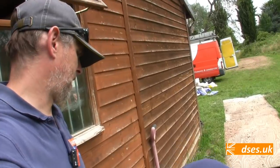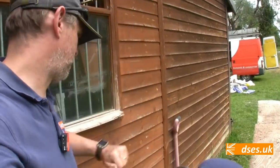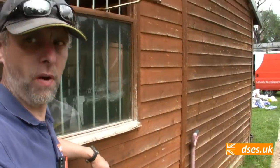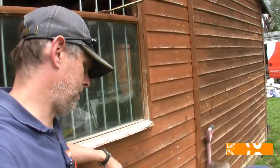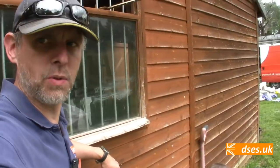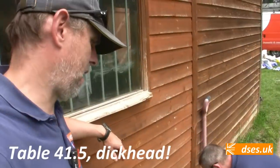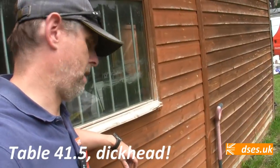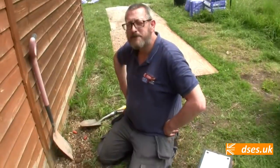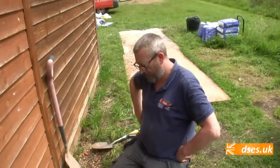Obviously, it could be as high as 1,667 ohms for a 30 milliamp RCD if you divide a touch voltage of 50 volts by 30 milliamps. Then you get a maximum resistance of 1,667 ohms, which is in table 50 whatever of the regs. Obviously anything below 200 ohms is desirable, because they say 200 ohms or above could be a bit unstable.